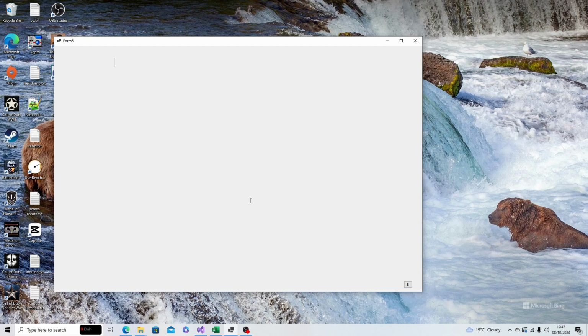So what's significant about that? Well, let's look at 16 address lines where they're all ones. And that's FFFF in hex. So what about FFF0? Well, it looks like that, where the last 4 least significant bits are 0. And we know that FFF0 is where the processor starts, and that's where we've added our machine code. And what we did was we went into the binary file and we added the entries in at location FFF0, then the next one FFF1, FFF2.